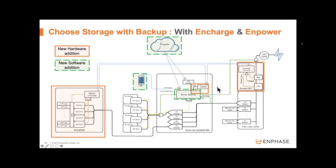So you can have solar, plus storage, plus a generator — this is really awesome. For those with an existing IQ6 or IQ7 microinverter system, you would only need the installation of the N-Charge battery and the Npower 200G with either a subpanel for emergency backup loads or have it tied into the existing service panel for whole home backup. A whole home backup option is going to cost more, so don't expect this system to be the cheapest on the market, but it will be an affordable option for retrofits and new systems when you compare it to a Tesla or a Sonnen. Enphase also plans on releasing the IQ8 microinverter lineup for solar panels one to two quarters after the release of the N-Charge batteries.